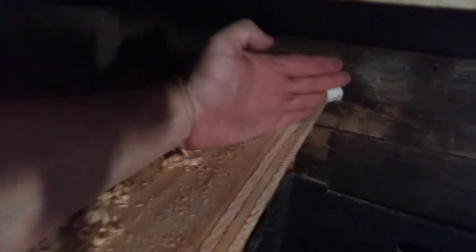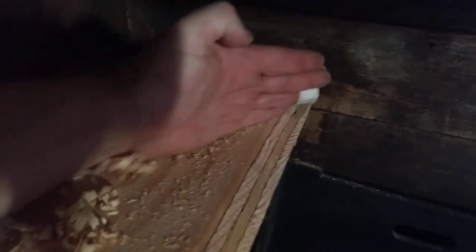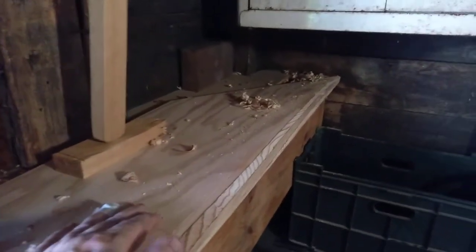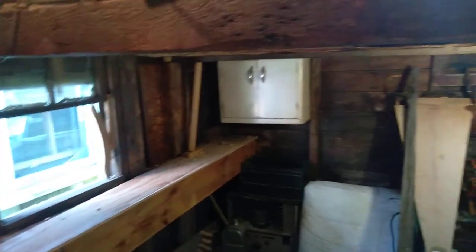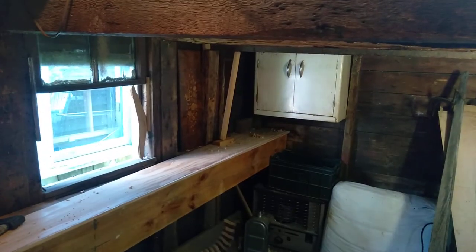But the transom's going to come in about here. So I've got a full bevel right where the transom's going to be. And I just sort of know that from experience and from a few measurements. When I was putting the plank on there the first time, I could see that it was longer than it needed to be. So yeah, I know that I don't have to bring that all the way out. But yeah, all right. So there's a garboard plank beveled on the bench.